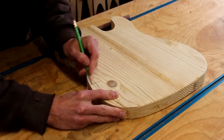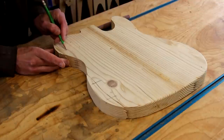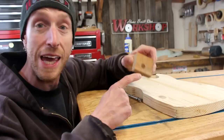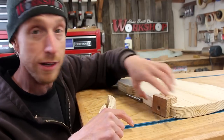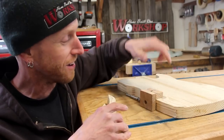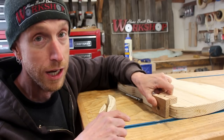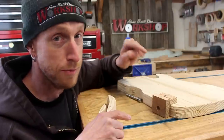I'm going to start out by putting the pieces roughly in place and putting a couple of pencil marks on there. Basically, I'm going to be putting this back together with some dowels. I've made up just a really simple drilling jig — it has a guide hole for the drill bit, and it is sized appropriately to give me the hole pretty close to the center. In the top, I've just drilled a sight hole with a couple of pencil marks that will allow me to line it up with my pencil line. That should help us get things drilled in about the same spot.